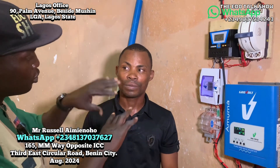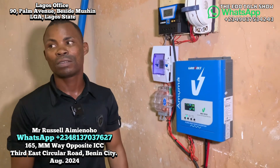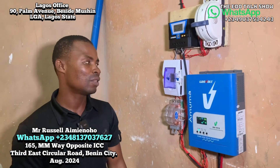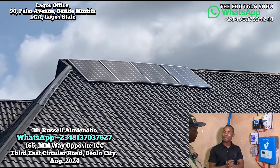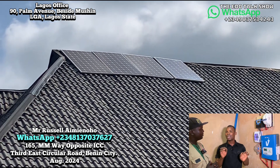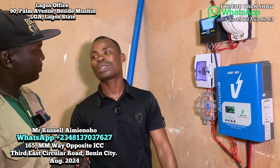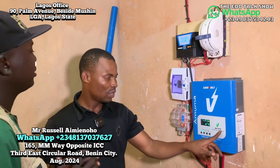So what if someone asks: for the group, can this four-bedroom apartment — will it power all the lights, TV from the community? Can it carry one fridge conveniently? Yes, one fridge no problem. The ones we have from grandfather era, on 2012 upwards, it can carry it completely. Let me say — how many panels are there? Four panels. Each is 350 watts, monocrystalline, monocrystalline — original ones. The monocrystalline ones give us 9.5 amps current. I checked today — 9.5 amp current. Before, the previous one was giving us — we can't control — but he sees 37 amps, which is good.